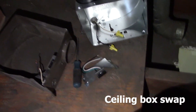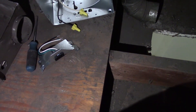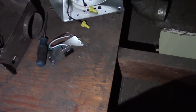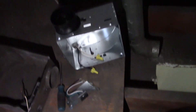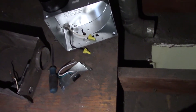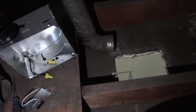We've got the wiring poked through that hole on the inside of the box. With our new box we have that little fitting with the socket on there — it just slides in and out, so I'll be able to wire that from down below. This box is a slightly different size to what was in there. So we are going to put this in position and put some screws in the flanges to hold them on the joists, then go down below and finalize the position before we finish driving home the screws. For the vent I'm going to put a couple of screws in there and also put some tape around it so it's mighty secure.